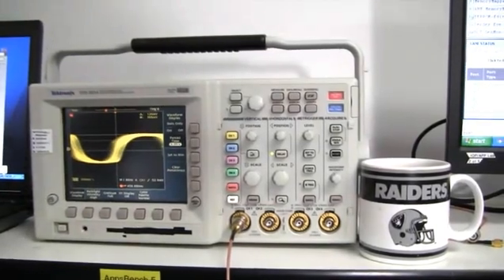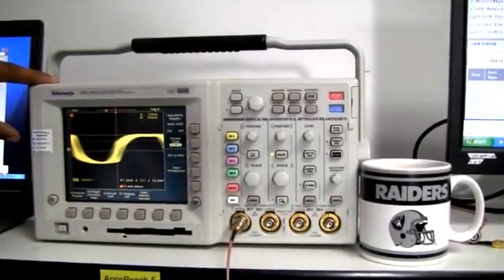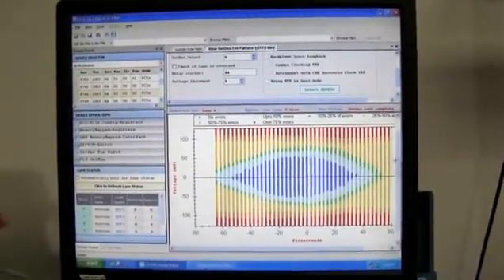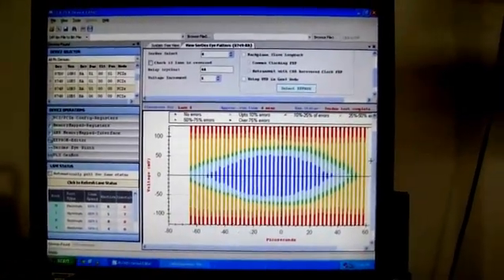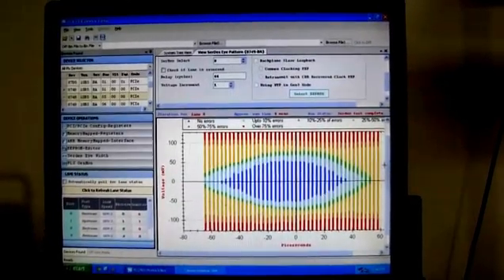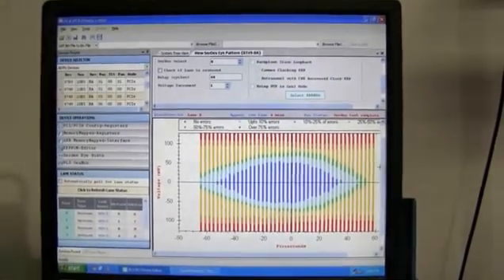Now I've switched the cables, and what you can see is the clock from the other side — the CPU side of the system. Again, a very spread signal. So with SSC now running in the system, as you can see, we have our port 1 active, our BY-1 Gen3 link. Here's the resultant eye that comes out of that link. Look how clean that eye looks — it looks as if there's no spread there at all. The system looks very clean. It's very impressive. We've clearly freed SSC from this box.